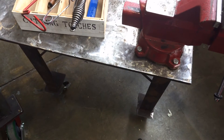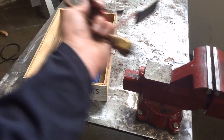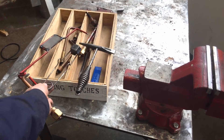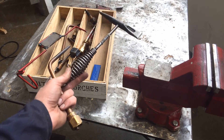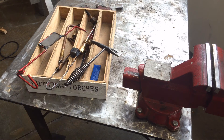Some other equipment you might wind up needing: if you're going to do work in the vise, we've got a little torch holder that can get clamped in the vise so the torch is held securely. We've got a striker here in order to light up the flame. If you're doing some cutting operations or need to do some banging out of slag, we've got a chipping hammer here — notice the non-flammable handle on there, so nothing will burn on that thing.